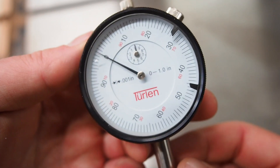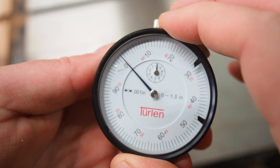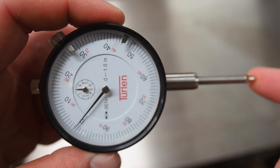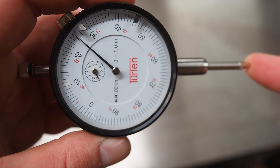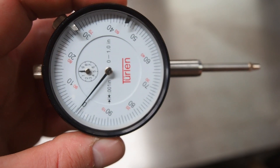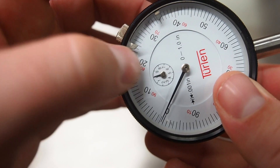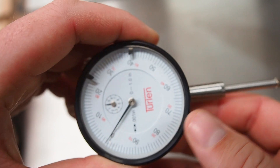Sometimes the gauge will be set in a weird place. If you loosen this set screw, you can reposition your whole face. So depending on how you set up your gauge — if it's mounted to a solid block or your miter fence — and then you set it against the blade of your saw, you're suddenly not set at zero anymore. So you can rotate that face to reset your zero. You've also got some little indicators here that you can set for an acceptable range or to mark where you started and ended. Let's jump to the saw.